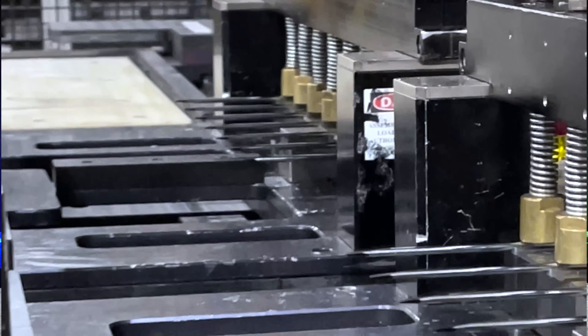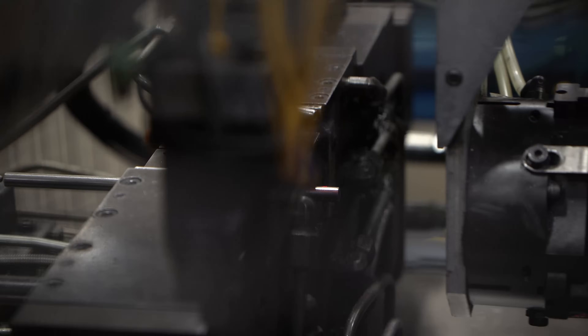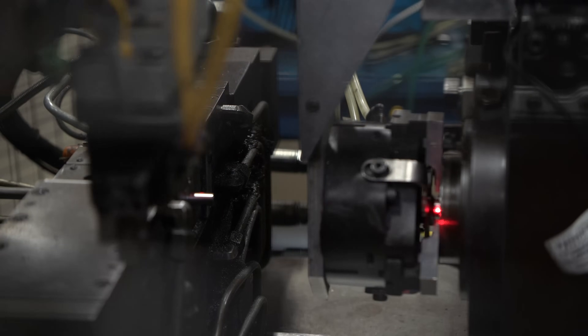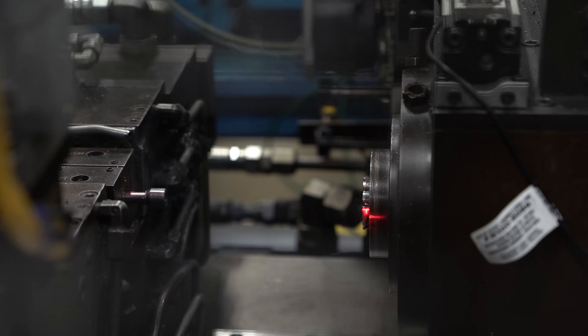The last process is the finishing. If you notice, the tips of a lot of Klein tools have a blackened part — a noticeable chrome shaft that goes into a black tip. That black is a metal oxide. They go through a chroming process to get the chrome, then a black oxide process to get that black coating, and after that they're looked over, packaged up, and sent out to Home Depot or wherever. For the nut drivers, it's a very similar process, except they make a hex tip for each size independently, then take the tip and the shaft and weld them together. A lot of them also have magnets on the inside.